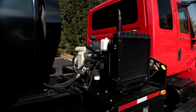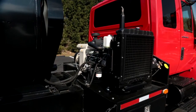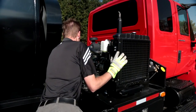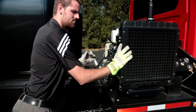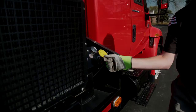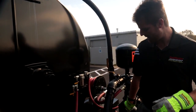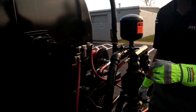We're going to increase our engine speed and engage our compressor in order to set the internal pump pressure on our 3 inch Gladiator pump. Here we are at the back of the machine — my engine's running, my compressor is engaged. We're okay to go ahead and set our internal pump pressure on our 3 inch Gladiator. First things first, we're going to open our main material valve.